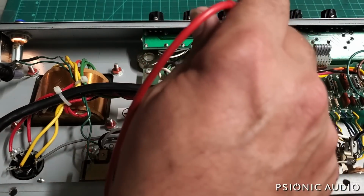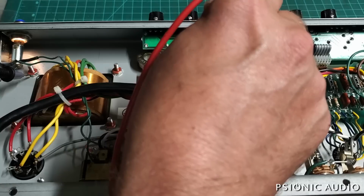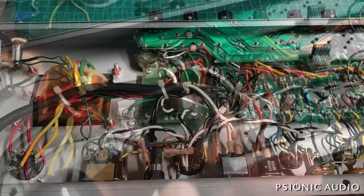So yeah, these screen grid resistors are just up in smoke. And there's barely a trickle. 84 and 104 volts on the other side. 413 on the supply end of things. Given that this is a low budget owner for his kid, I'm going to try to work with him on the budget and keep this as an inexpensive repair. Let's see what I can do here as a reliable, inexpensive workaround.